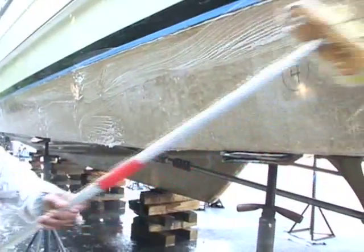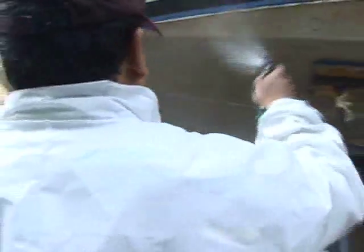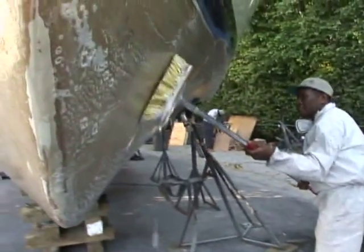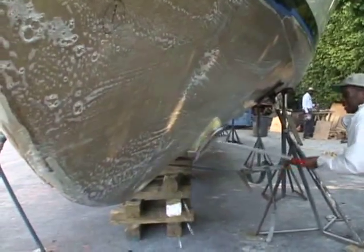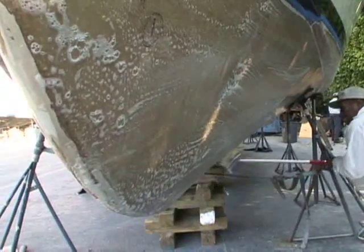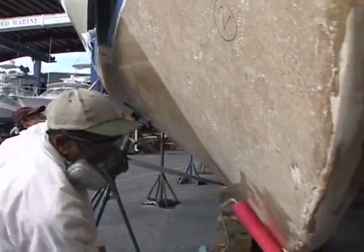While you're waiting for the bottom to dry out, it's time to wash the bottom — at least two or three times a week is recommended — because one of the byproducts of polyester resin breakdown is glycol, a water-loving substance. If any of it remains, it will suck moisture right back into the laminate. By washing the hull, you encourage any glycol left to migrate to the surface where it will evaporate quickly. At that point, you take your final moisture checks and apply your HT9000 epiglass.